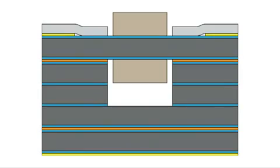PC MEMS allows a wide variety of materials. This cross-section view shows Mobi uses 5 layers of carbon fiber for rigid lightweight components, 2 plastic layers for flexible joints, 2 brass layers for locking, 1 layer of titanium to mimic insect wings, and 2 piezoelectric ceramic inserts for actuation. 8 layers of adhesive bond to stack together, creating an 18-layer laminate.